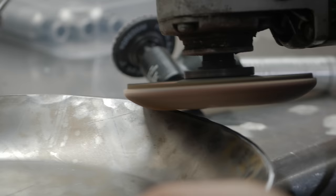The cold forging gets us the shape that we want. Hot forging, on the other hand — where we do the handles or smaller things — that's our chance to really change the shape of something, like the fullering of the handle, where we're really putting a different shape on it. Now that it's heated up with that nice orange glow to it, it moves a lot easier when you put it in the fullering tool. We've got our fuller and our reverse fuller at the top for comfort, and we've got our hammer marks on here, which are there to just make it nice.